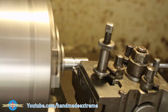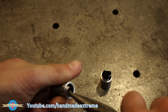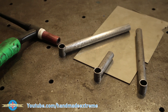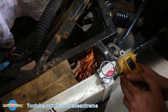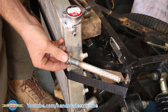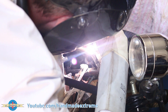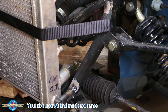I started by parting off some short lengths of steel tube — these are going to go onto those little bits that stick out on the side of the radiator. I could then use a hole saw in the milling machine to cut some bird mouths in some other bits of tube that will become the main bit of the radiator support bracket. Here's how the brackets fit together before welding. I had to clean a bit of the old paint off the chassis rails before attaching the brackets — an angle grinder with a grinding wheel made light work of that. Here's the top bracket fitted, and working on a car chassis with a TIG welder can be a bit of a fiddle — this is where a MIG welder would be really handy. Here are the lower and upper support brackets tacked in place.